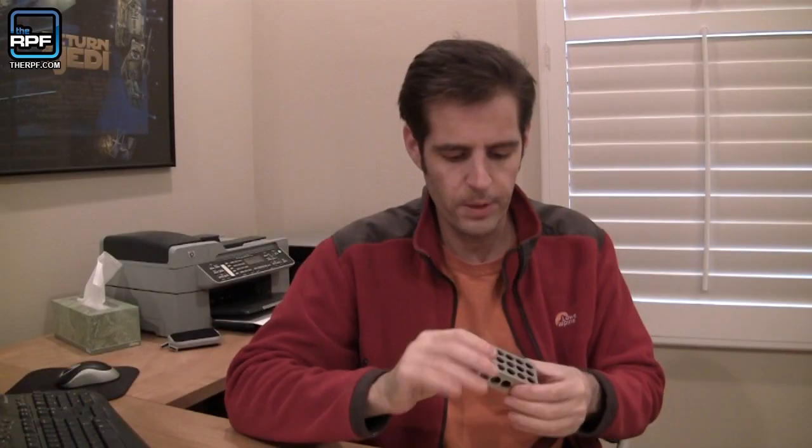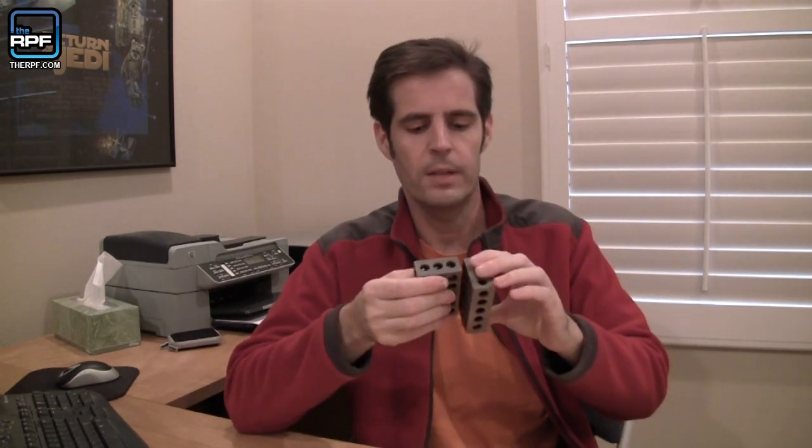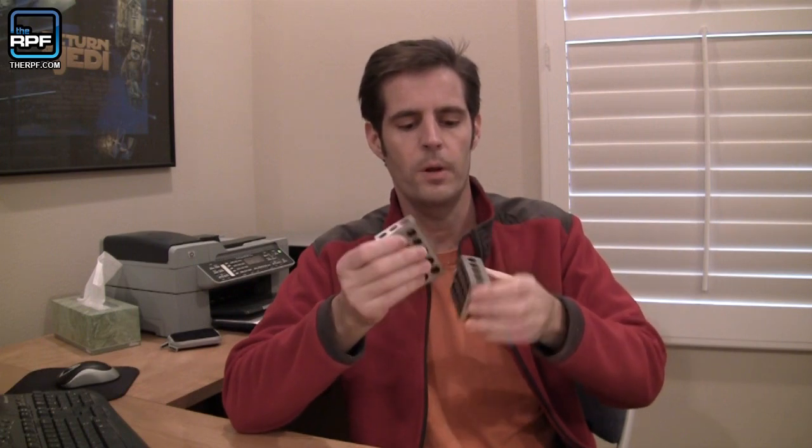These are called 1, 2, 3 blocks because of the dimensions they occupy. So it's 1 inch by 2 inches by 3 inches. And they've got a bunch of holes drilled in them, and some of them are tapped, which allows you to join them together in different configurations depending on what your needs are. I haven't so far had use to join them together, but you get the idea. So let's head out into the workshop and I'll show you how they're used.